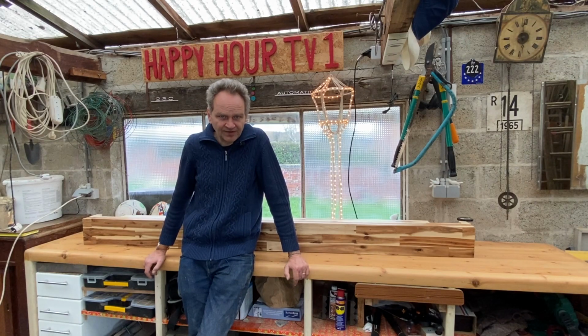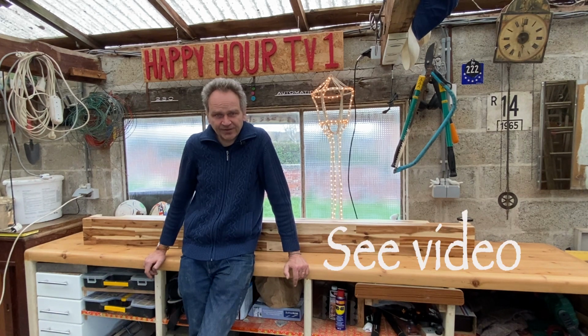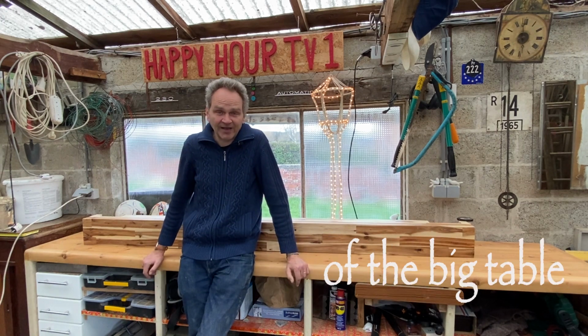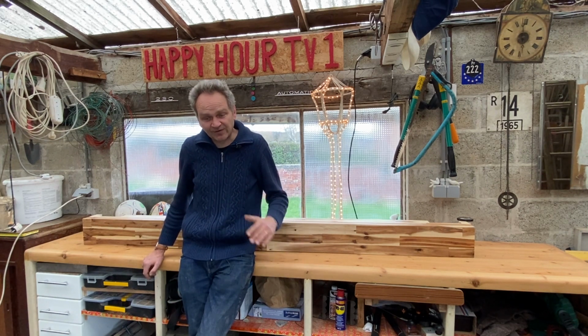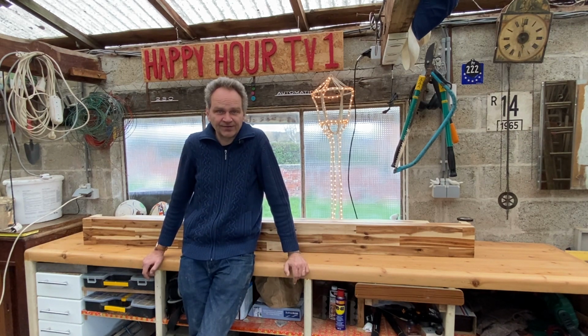Further indication this time for this last phase. Here, for reasons of speed, I proceeded with waxing, which I shouldn't have. I should have directly put a varnish on this table. The wood was already perfectly ready for applying it, only a bit of sanding before. It would have given much better results, not only in the overall texture and protection of the wood, but especially for the different colors which appeared because of the fact that it was a used table.